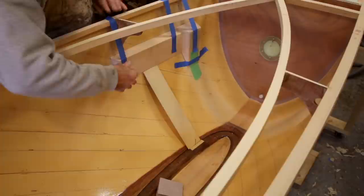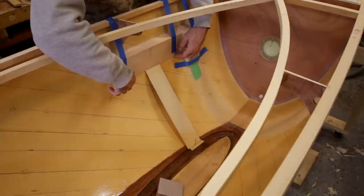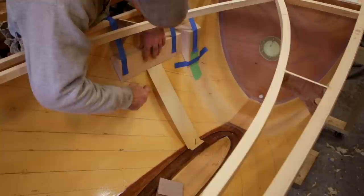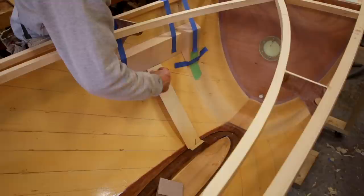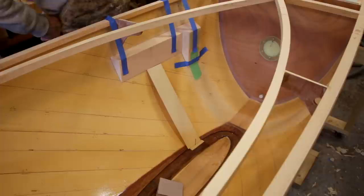Okay, that's pretty good. Now, the danger, of course, is that when you grab things from the top face like that, it wants to tip out, and that's what I'm trying to avoid. Now, the one thing I can't really do is pop nails into this hull very easily at this point because it's so thin. It's just a quarter of an inch thick. I think that'll work if I can just prop that up a hair. Now, of course, this will get glued on if I'm not careful, so I think what I'll have to do is wrap that in tape so that it can't get glued in place. Hopefully that'll stay. I might even add a little tab onto the surface here so it pushes against. But all in all, that looks really good. That's going to work out well.